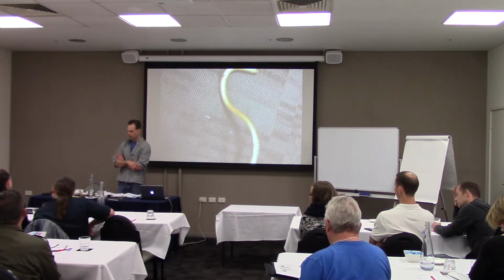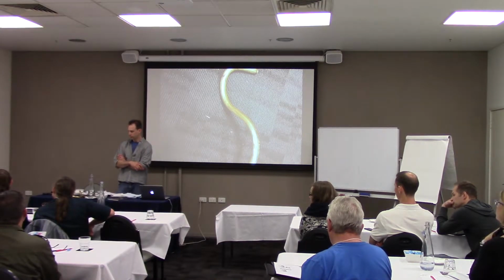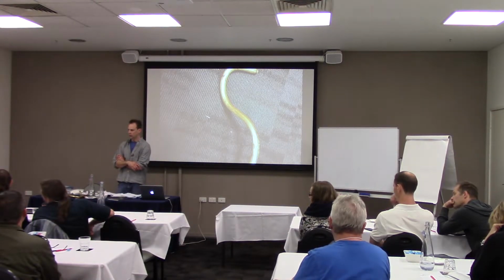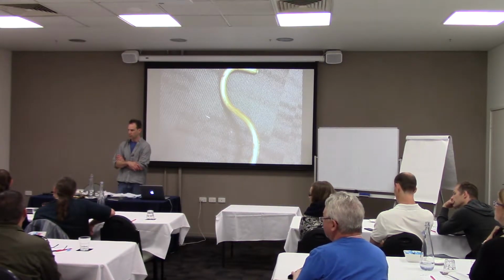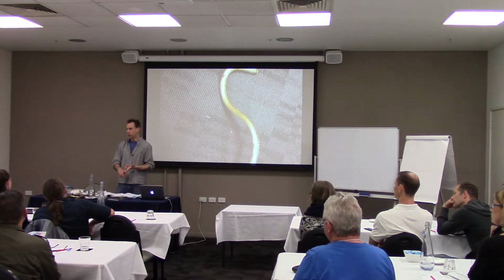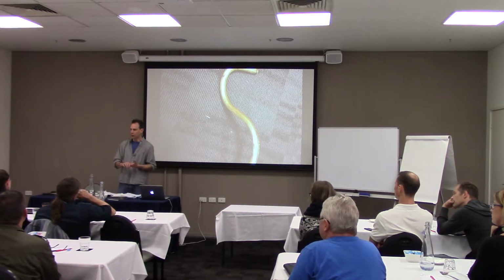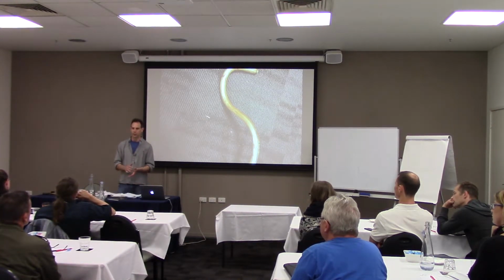We were talking before about the crystalline structure, and if you look at that bend, the internal bend of the crystal, they can be shorter, and they can get stretched on the outer bend. Right. How is that affecting the strength of the brass? Well, I think again, just like your dent machine, there's compressive and non-compressive, and I try to use as much non-compressive dent work as possible. I want to work it from the bottom or burnish it from the top. Last resort is you want to go mashing grains.